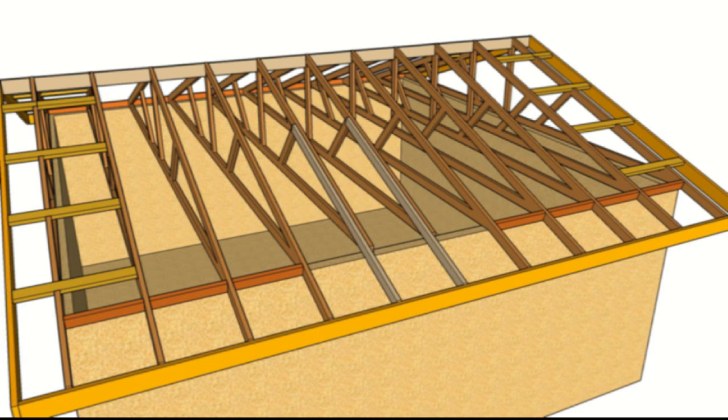After that you will install new rafters. The rafters will nail right next to the roof trusses — the concept is simple. I left the fascia board on there, but in some cases you're not going to be able to get the roof rafters in with the fascia board there. Don't forget you can always go through the attic if you have the room, or slide them through the areas where the blocks were and then stand them up. Some of the rafters will need to be notched to fit where they sit on top of the wall.